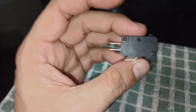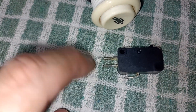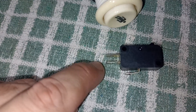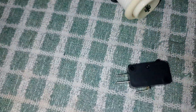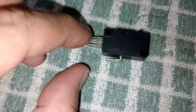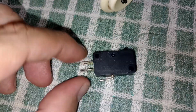Here's what you need to do. A micro switch has three legs: this one here is the ground, which you will definitely use. Then you have two other options: normally open and normally closed. For arcade games we always use the normally open option — that means the signal wire and the ground wire will not touch each other until you press the button. The other option is the exact opposite: the wire and ground touch all the time until you press the button and break the connection.